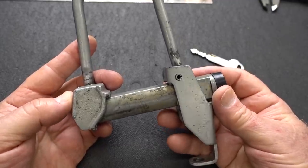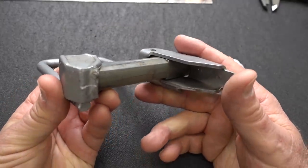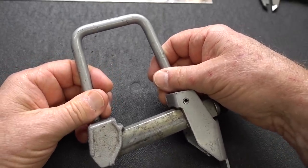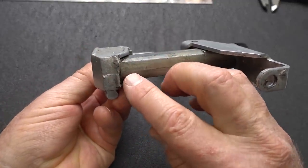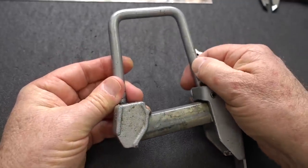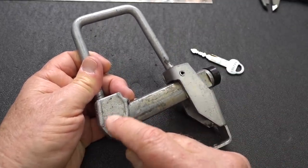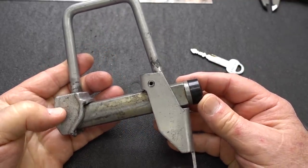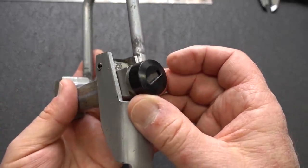Having lived in Europe for so many years, this was the bicycle lock style of choice - I've never seen one like this before. My first attack, when I got to looking at this thing, might be to try to bend it. But remember, this is actually clamped to the frame, so that's going to really prevent you from prying it. My first thought was to jam something up in there and pry it loose, but that's not going to work if it's clamped to the frame. Plus it's pretty heavy steel, and that probe sticks out probably close to a half inch inside solid steel. I do have one possible very quick access attack, but I don't think that's what he intended - I think he intended for me to pick this guy.